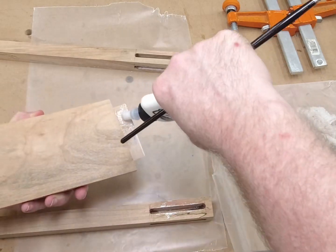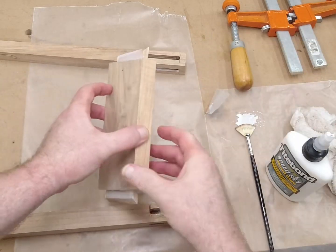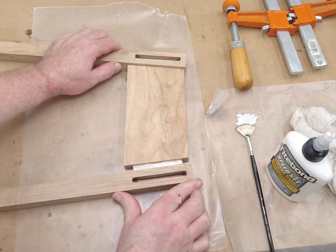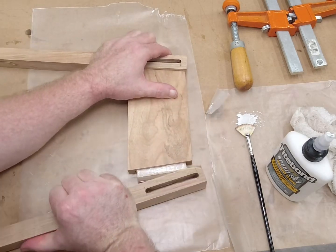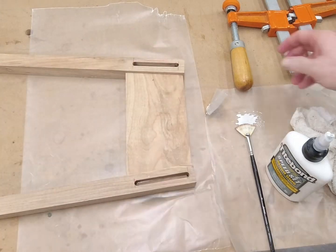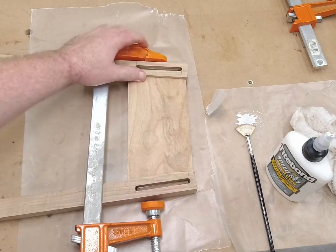This popular method of just squirting some glue in the mortise and banging the tenon home was tested by some woodworking magazine like years and years ago, and it was found to create glue-starved joints fairly often. The only guaranteed way to get glue everywhere it belongs is to put it there on purpose. This also has the benefit of greatly reducing, if not eliminating, squeeze out altogether.